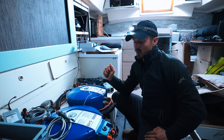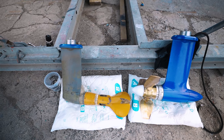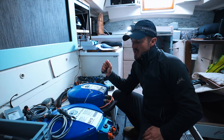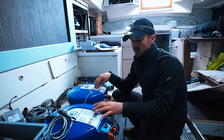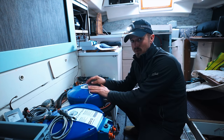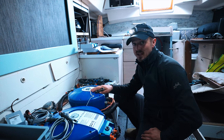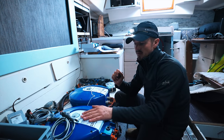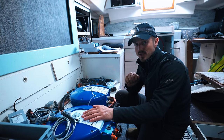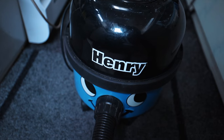Well, I know a lot of you might be wondering why we can't just take the servoprop sail drive, the skeg and the propeller underneath, and just bolt it onto our old motor. Although these two motors look similar and the internal components are quite similar, one is designed for the servoprop and one is designed for the folding propeller, and the parts aren't exactly interchangeable. Now that the old one's out, I'll pull out the old motor controller as well, and then we'll pop the new motor in, bolt the new sail drive on the bottom, and with a bit more rewiring, we'll be good to go.